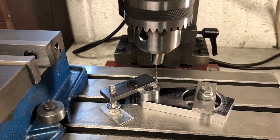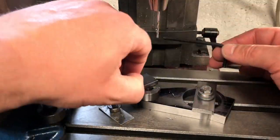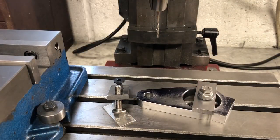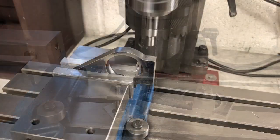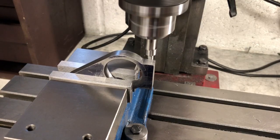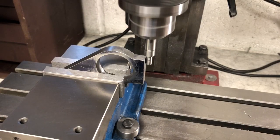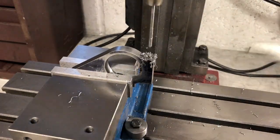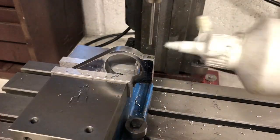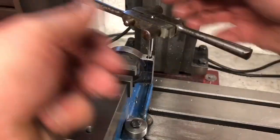Still on the table, I have moved the part and set up the guide bush for drilling the one-sixteenth pin hole. The bush is located on the three-eighths bolt hole by a dowel pin, and once that hole is well established I can remove the bush to complete the drilling. It is worth pointing out that I have positioned this so that my drilled hole is going to emerge into a T-slot and not damage the mill table. Into the vise now, and I have oriented this by using a square on the table itself to set the bolt hole vertical. Edge finding this part makes dialling in the hole location trivial. And after centre drilling, we go pilot drill, tapping size for M5 all the way through, and then M5 clearance just over halfway, followed eventually by an M5 tap.